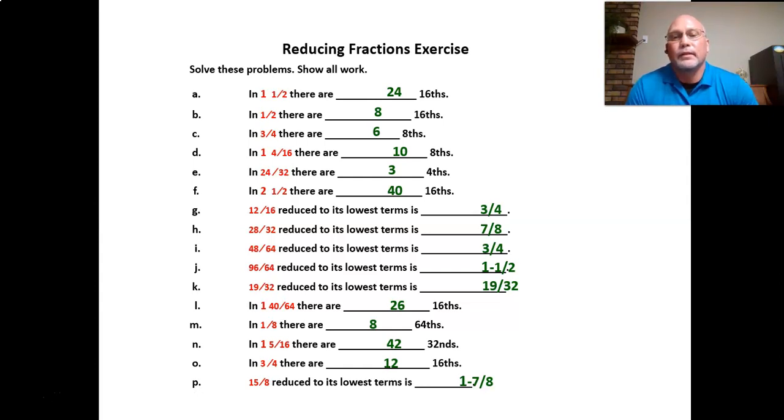And then looking down the list, oh, we got 3/4 of an inch. How many sixteenths are in a 3/4 of an inch? With sixteenths, you take the 3/4, the fourth, and multiply that by four. You got 3/4, you got 12/16 in a 3/4 of an inch.